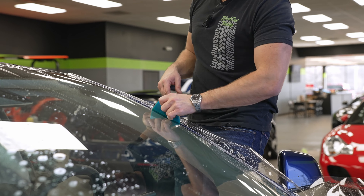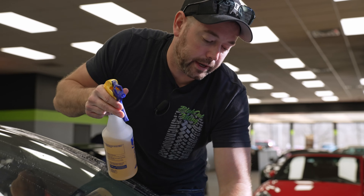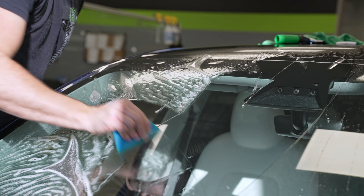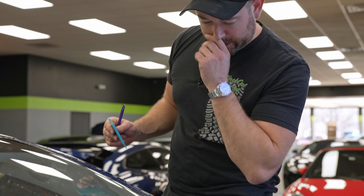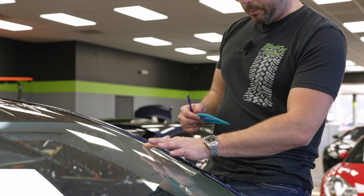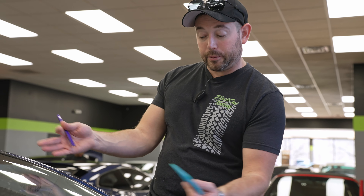Part of the problem is I just have so much extra material, so I need to get a knife on this soon. You can see those fingers that were this long are now reduced to just a couple of inches. They recommend using steam with this as well, and we haven't even gotten to that point yet. I squeegeed over a big finger here — it wrinkled, a pretty big horizontal wrinkle. I squeegeed it back down after I sprayed it and I could still see the wrinkle, but then I worked down here, looked back up, and the wrinkle is gone. That's pretty cool from an installability standpoint.